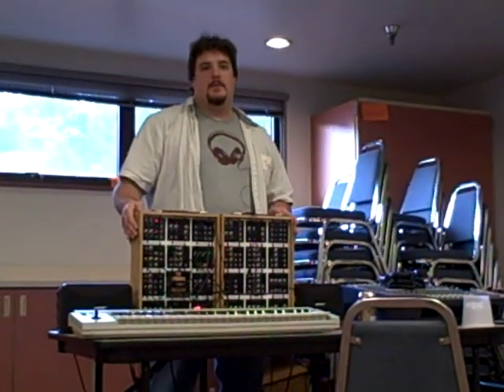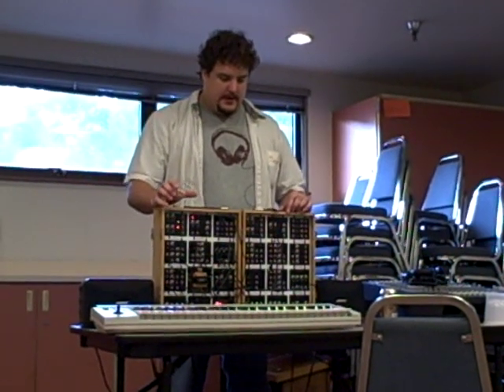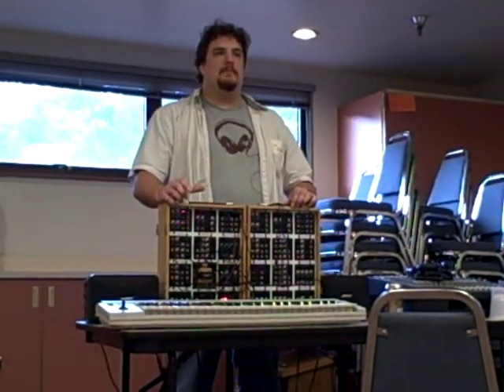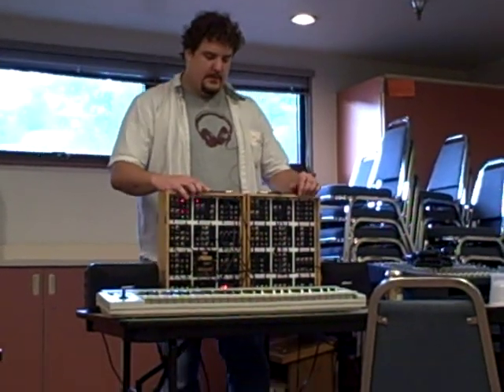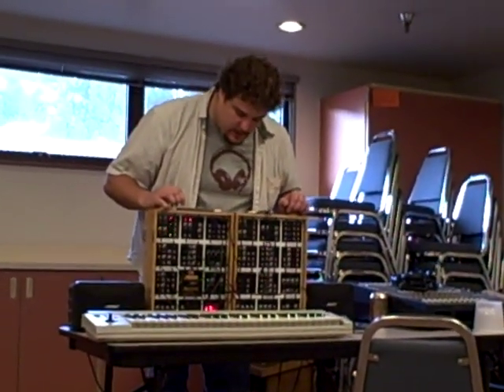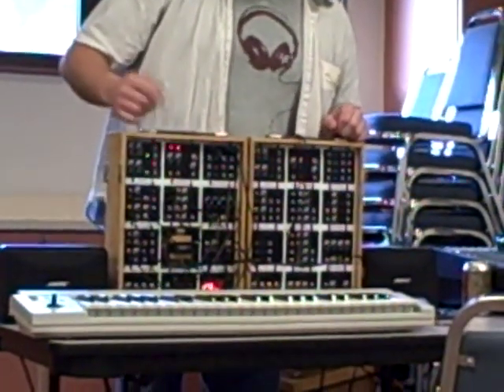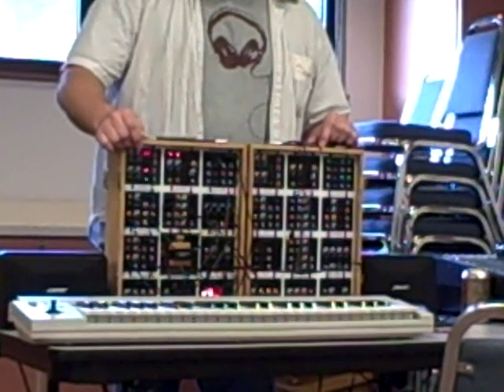Another thing I brought is my MMM. I'll let the other guys talk about it a little more. I'm designing the MIDI-to-CV converter for it. George keeps asking for all these changes, so I got tired of pulling the thing out. So I designed my own custom module here with a ZIF socket — pull the chip out, put it in the programmer. It makes it a lot easier.